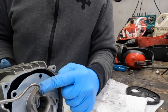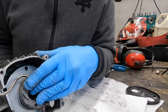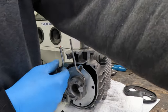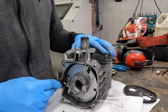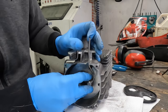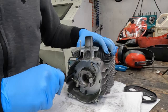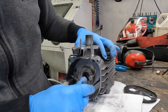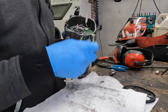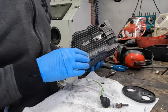I've already got the fuel and air injection line inserted here and I'm hoping that it still clears the fan — it did the last time I checked. I had a new one of these that I wanted to use, but I'm going to need to use some sealant for that line anyway, so maybe we'll just use sealant on that too. I'm going to try running this with the end open at least at first. I don't know that this has a mesh in there — let's check to make sure there's a mesh. There is not a mesh. Good thing I checked.